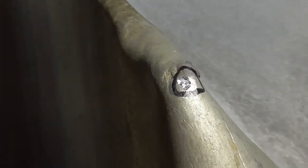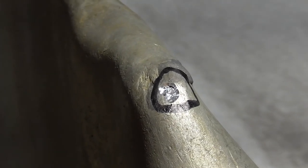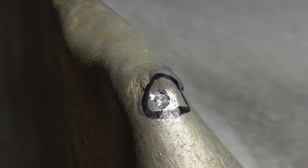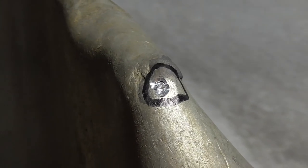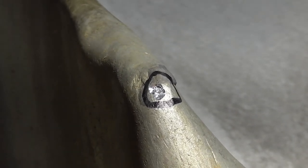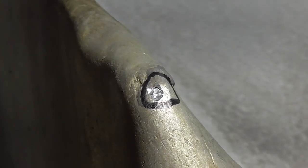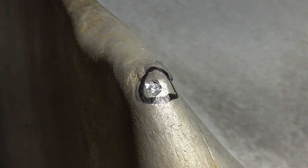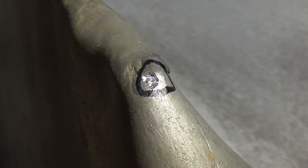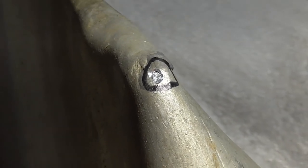All right, so I just took a drill. Whoop, a little blurry. And I drilled it out in two spots, and you can see it started coming through there on the top. What that's gonna do is let me get in there with a full penetration weld and repair this thing all the way through. And then I'm gonna try and do a little bit of padding on it because I know this guy's gonna ram it into the ground again. We don't want it coming back now, do we?